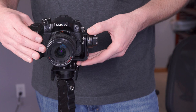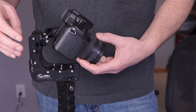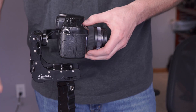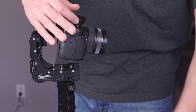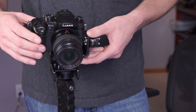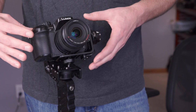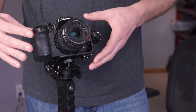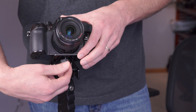I've loosened these four screws enough so I can bring the camera up and down and it'll stay in place. The manual talks about how you're supposed to be able to leave it at a 45-degree angle. Unfortunately, this eyepiece — which I can take off — throws off the balance a little. So I'm going to move this up. Right there it's staying at a 45-degree angle. Now I'm going to tighten this up — and now I'm off just from tightening that.